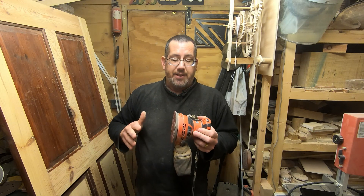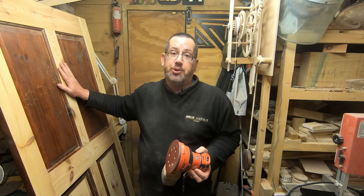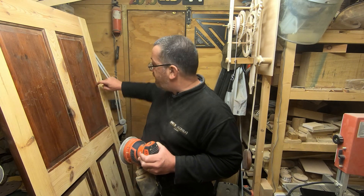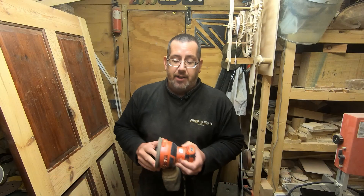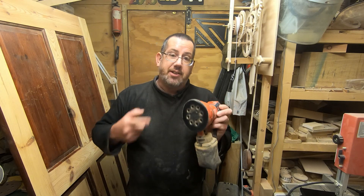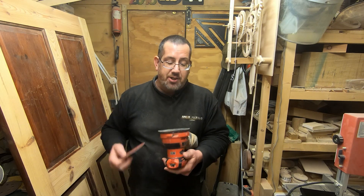The second thing I get asked about a lot is do the pads come flying off. I damaged mine literally on the first time I used it, on an identical door to this one. I sanded all the flat areas and the flat panels, but I made the mistake of going up to the edges where it was biting up against the rims. I'll show a photograph - you can see on the edge there's one fairly damaged part on the pad. However, the pad on this fits just as well as it did from probably the day I bought it. I always make sure it's stored with a pad on there because it just stops wood shavings collecting on it, which is possibly what will cause damage.